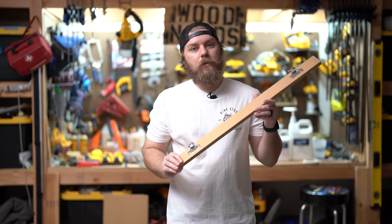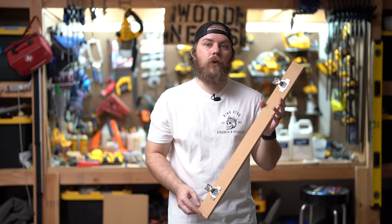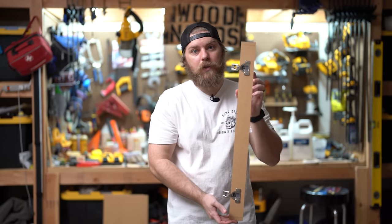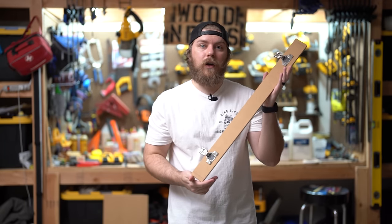Hopefully I was able to give you all the information you need to upgrade your cabinet doors and drawers. If something wasn't clear or you need more information, drop me a comment — I reply to almost every one. I highly recommend building the stile jig for installing your cabinet doors. Cutting one extra stile is little to no extra work, and it allowed me to mark equal distances on the top and bottom to center doors vertically and get repeatable installation points for the hardware.